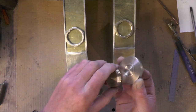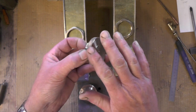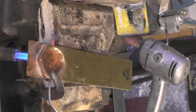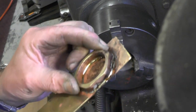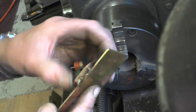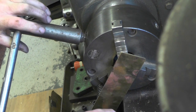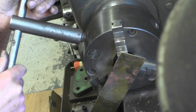By doing it like that I've been able to get my thread right up to the back and keep the length short - so that'll be on there. Once it's all soldered together I can put it back in the lathe and just take a trim across the top to make it, probably dome shaped. I'm over on my Harrison lathe now and I'm going to set this up in the three-jaw chuck on that hexagon, bore it to the diameter of the thread so my plug will go in. If you haven't got a lathe with a swing like I've got on my Harrison, you'd just have to ream it out and file it, or you could do it on your milling machine.